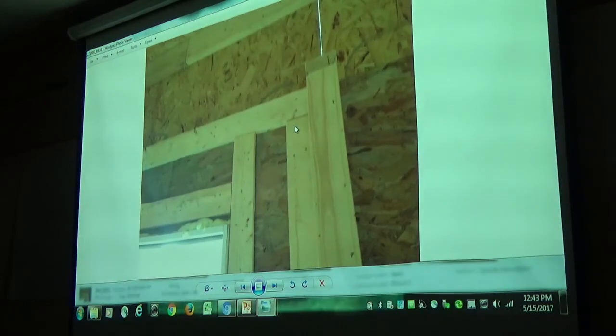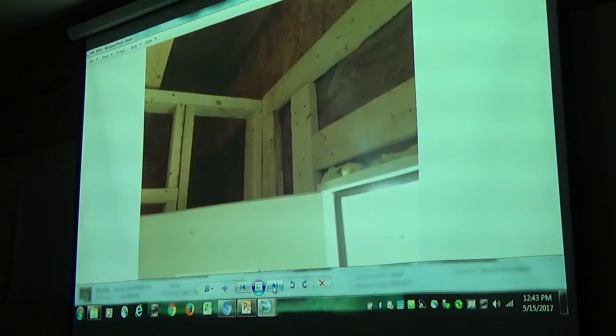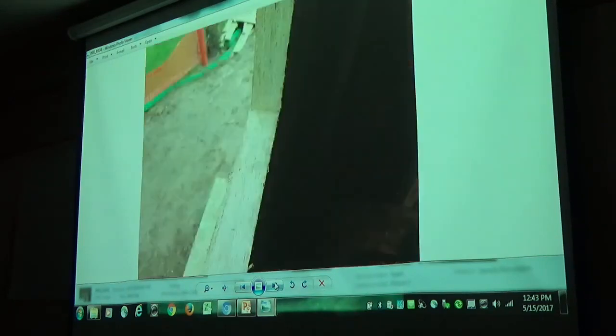electrical that lives on the exterior walls is either run in the baseboard, right? It's all those outlets, or you've got two switch boxes, one at the front door, one at the back door, and they're in this sort of built-out, furred-out framing that occurs at the front door. And this is like the interior closet. And this is just flat framed because you got 2 1/4 inches already out there, right? And so you just need a total of 4 inches of framing. Okay.